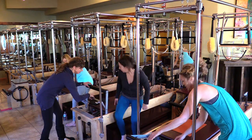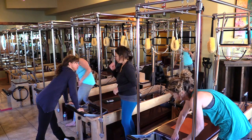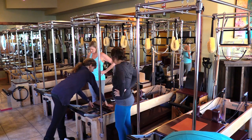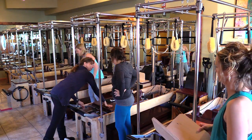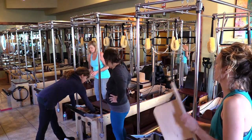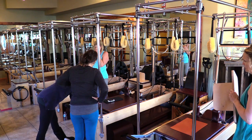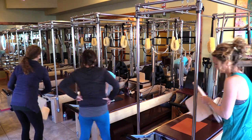The little bar goes up and around towards the carriage. The one place that the machine will bite is right here — so you never want to let go. It will take a fingernail and bruise it badly. Preload goes up on this spot right there — double-check it because it's your lifeline. If it's not there, it's going to be really spooky.